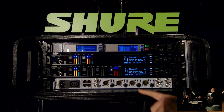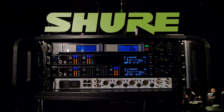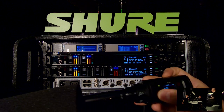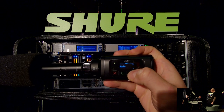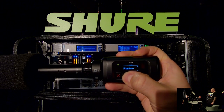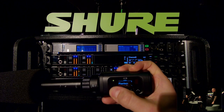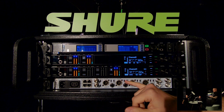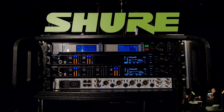After syncing but not getting audio, checking the receiver front panel shows a 'phantom off' icon. Since this is a condenser shotgun microphone, phantom power needs to be enabled. Going into the menu, under audio, the first option is phantom — enable 48 volts of phantom power, exit, and the receiver front panel now shows audio incoming and a '+48V' icon. Regarding gain in digital: unlike analog where you adjust sensitivity before transmission to maximize signal-to-noise ratio, in a digital system the incoming audio is converted to a digital bitstream almost immediately at the transmitter, so all gain adjustments are done at the receiver end in the digital realm.